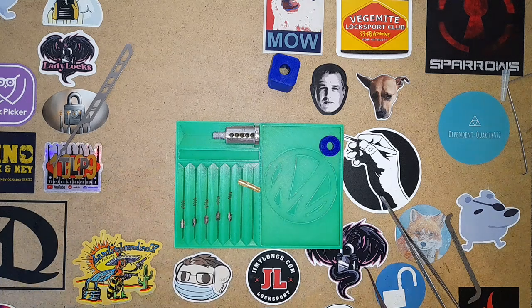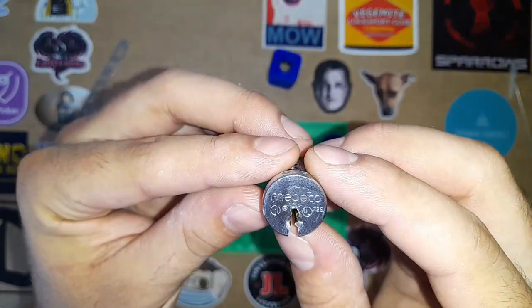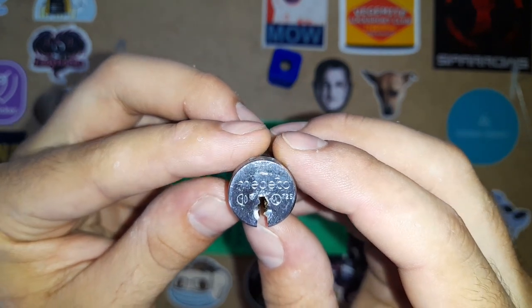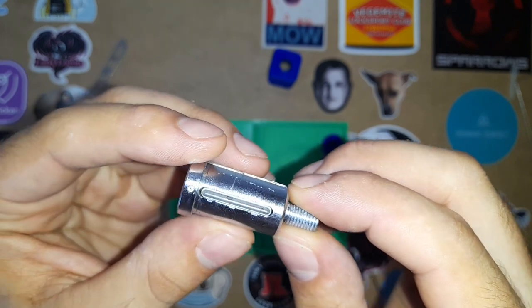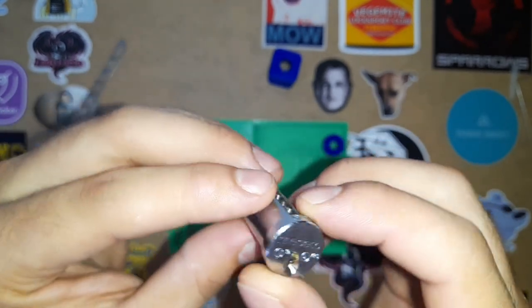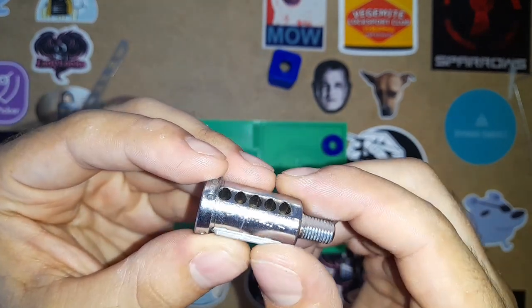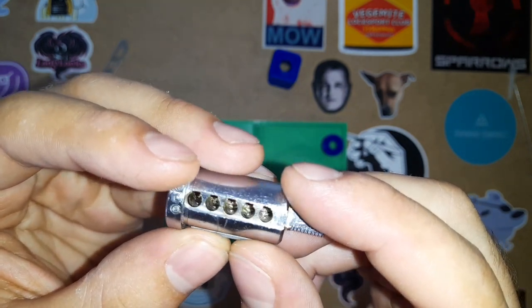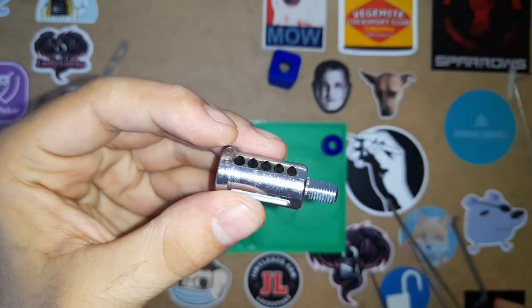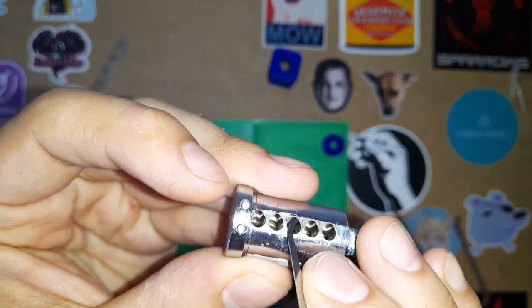Hello everyone, Independent Quarter here, and today I have a very interesting lock, and that is the Medeco Biaxial Cam Lock. It's a 5 pinner and it only has key pins and a sidebar. They interact with the sidebar, but like any Medeco lock, you not only need to lift them, but you also need to rotate them. That's the reason why that chamber looks kind of strange.